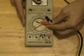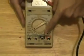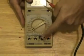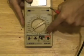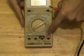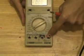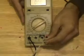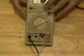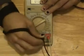If you notice down here, we've got probes — these are called banana jacks. They're fairly common and easy to get your hands on. We've got four ports: the middle one is called common, or common ground, so we keep our negative black lead plugged in there. The next port tests voltage, ohms, and diode check — it's all clearly labeled, and it warns you that this port should not go over 1,000 volts DC or 750 volts AC. There's a 10-amp line port, so if I wanted to test something at 10 amps I'd plug into that one. If I wanted to test milliamps or microamps I'd plug in over there. For anything up to 1,000 volts, I'd go into this port.